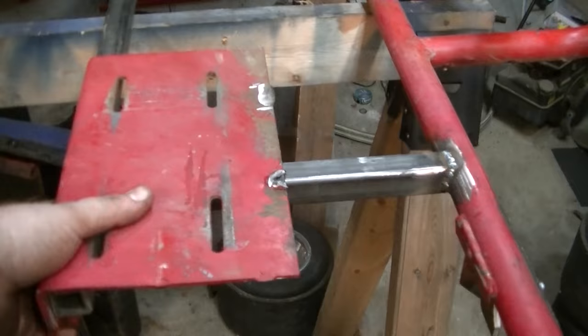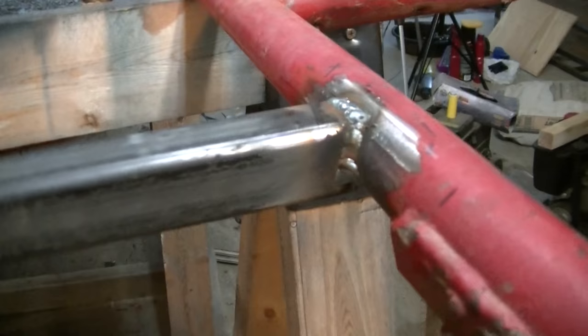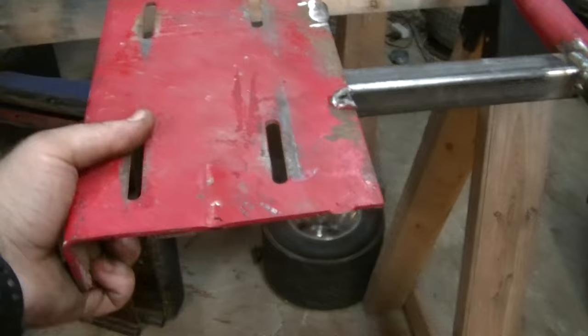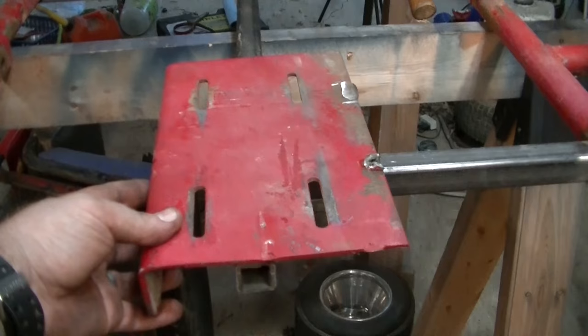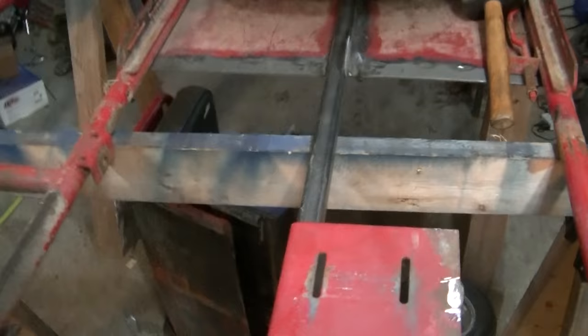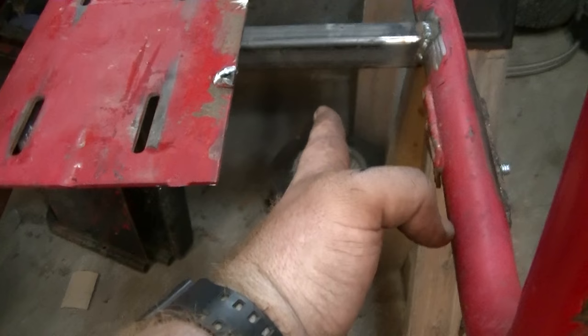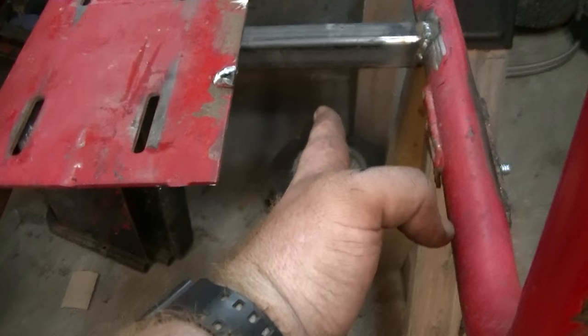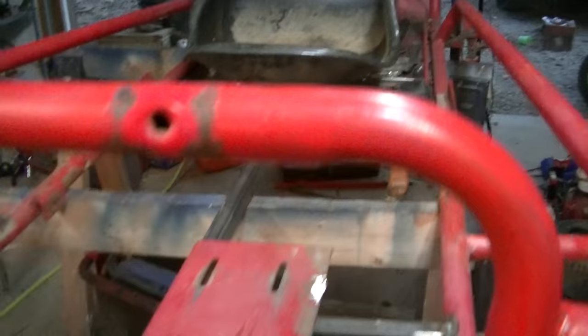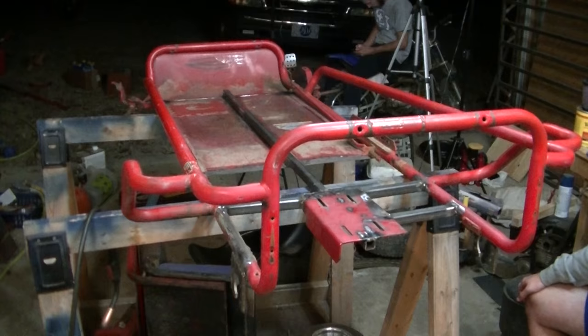With the engine plate, this is what I decided to do. I welded this bar in here and rounded off my cut — I rounded off that piece of square tubing so it fit against the pipe really well. This is going to set centered on this pipe and get welded on. At the back of it I'm going to do square tubing going from this to one side and from there to the other side to brace it up back there as well. My disc brake will ride perfectly right here on the axle, only about an inch away from this square tubing. Then I can mount my caliper right here and run the line up with the master cylinder, mounting it somewhere along here so I can still work that brake pedal just fine.